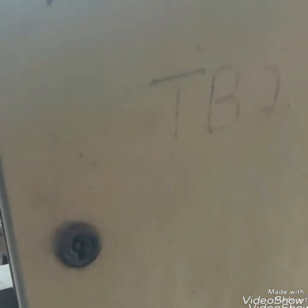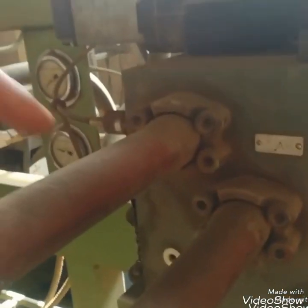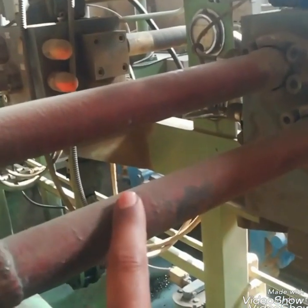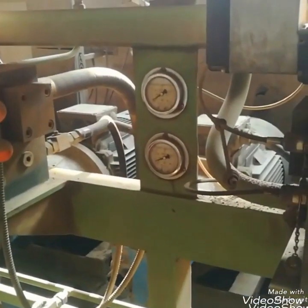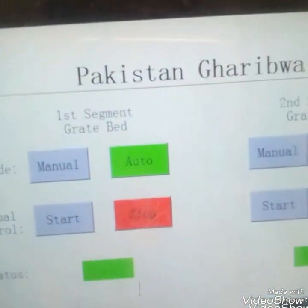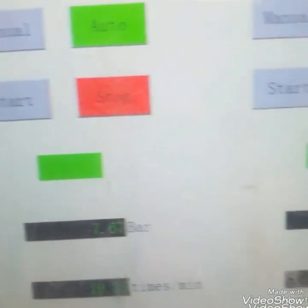This is the overview of this hydraulic system. These pipes deliver pressure to the jack in the reverse or forward direction, and the proportional valve gives strokes through these pipes so the jack moves forward and reverse. Here you can see on the gauge the pressure going reverse and forward — one gauge is for reverse and one for forward.